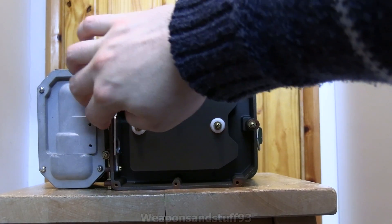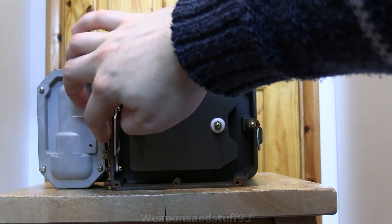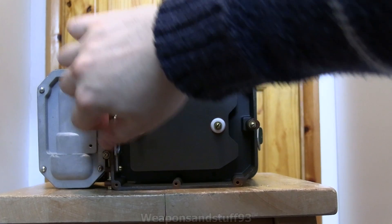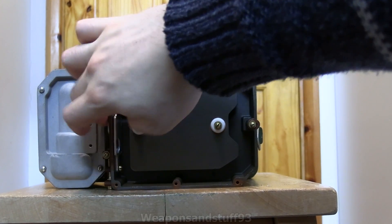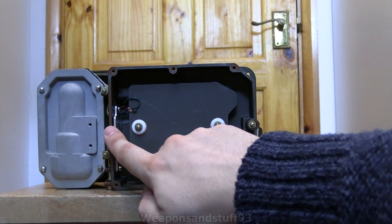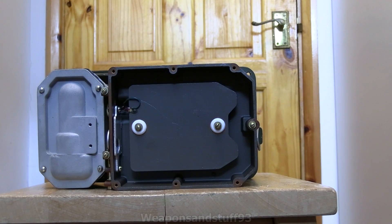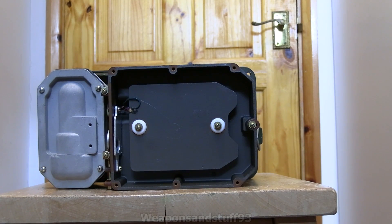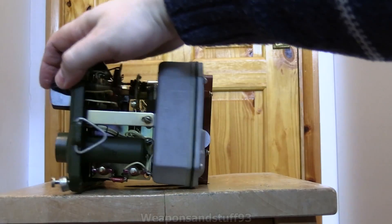Now the check source used to go here — it used to be mounted there, and this is the shutter button. Basically what would happen is the strontium-90 is disconnected from the ionization chamber. When you press the shutter button, that moves the shutter out of the way and the electrons flood into the ionization chamber giving you your reading. Why they didn't just use a little bit of americium or plutonium or polonium I don't know — that would have been a much more sensible choice. Instead they had a piece of strontium-90 that some people have measured at over one millicurie. That's where the high voltage electronics are sealed, the same as the DP-23.